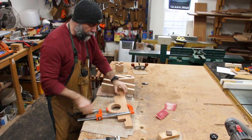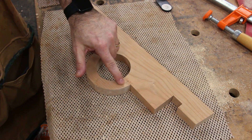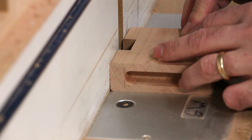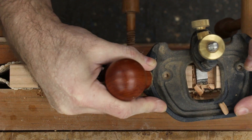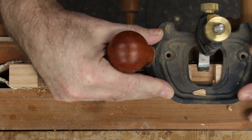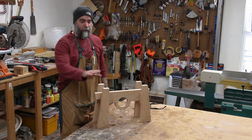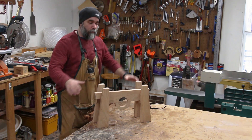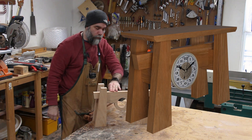Last night I glued the bottom arch piece onto the stretcher. I thought about using a dowel to join the bottom arch piece to the stretcher, but because this is long grain to long grain, the glue joint should be strong enough. It's been so cold in the shop that it's actually below the chalk temperature for the glue I'm using, so I did the glue-ups inside the house and didn't film them. The first thing I did was glue up the two sides of the clock, let those cure overnight, and then glued the two sides together with the stretcher — nothing complicated.